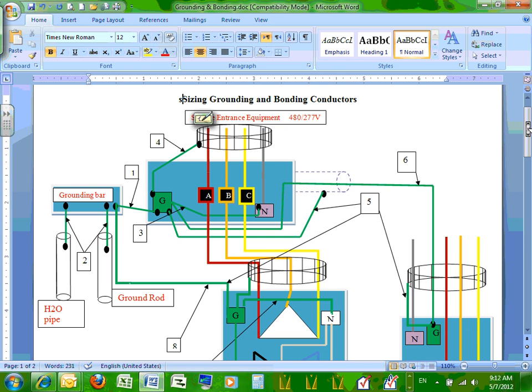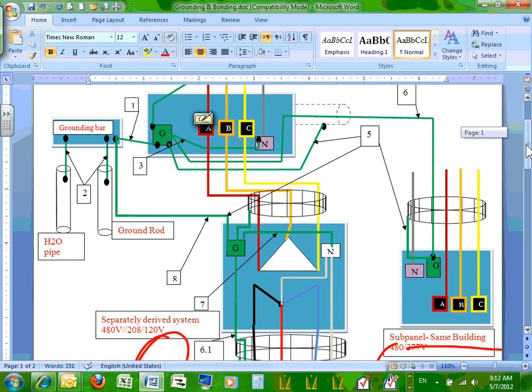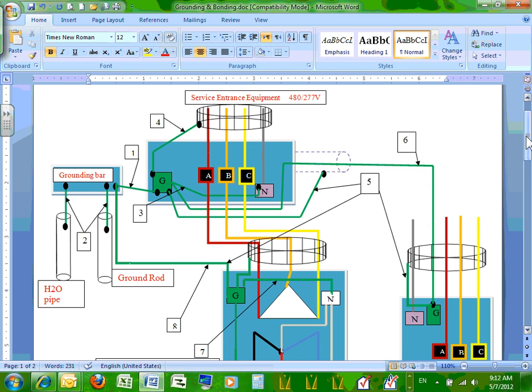So number three. Anybody knows what number four is? Look at number four. Can you guys see number four? Number four, Chris, you came from an open switch gear. The bottom of the switch gear is open, right? When you guys were looking at the switch gear at EMI, what happened to the bottom of them? They're open. So you're coming with rigid metal conduit to the bottom of the switch gear. How are you going to tie the metal rigid conduit to an open bottom of a switch gear?